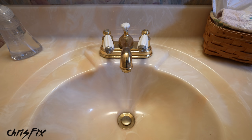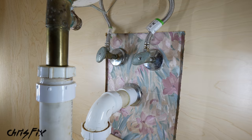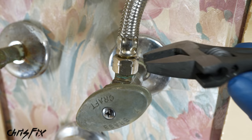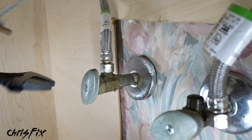With the water off, go back underneath and disconnect the old faucet from the sink. First we need to remove both supply lines — that's the hot water supply and that's the cold water supply. Before you loosen these, get some type of container or towel to catch the residual water left in the lines. With the catch can in place, use an adjustable wrench to break loose the nut on the line, then unscrew it the rest of the way by hand. Now let's break loose the other side and remove it as well.